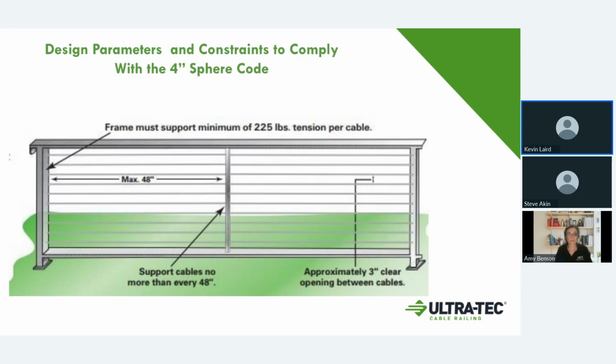If you do have to stretch your intermediate post out beyond 4 feet, we've gone up to 5 feet. You just want to tension that cable a little extra. The cables will take tons of pressure. You'll bend your post before you break the cable.